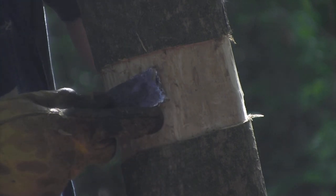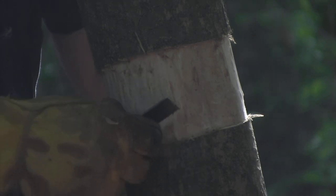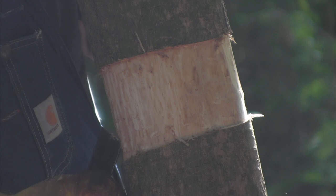You can see here I'm pulling off something that's more like a film — that probably is either the inside of the phloem or it's the cambium itself. The cambium itself is what we need to remove. The outside of this wood is shiny; if it's shiny, it has cambium on it. We could continue scraping here to get these blotches off, but let's stop and go to scrubbing.